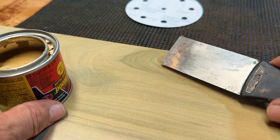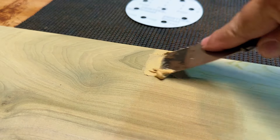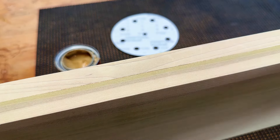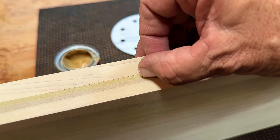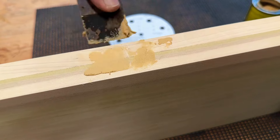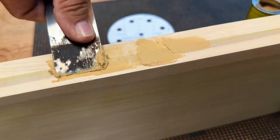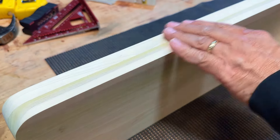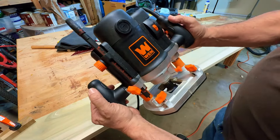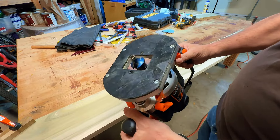After the second sanding I'm going to fill in these little voids and get it ready for paint - just put enough on there and we're going to sand it down. To get that perfect finish for the paint, see this glue seam right there? There's no void there but it looks like it, so if you're not sure just grab some filler and run it across there. Better safe than sorry. I'm gonna use this Wintech 15 amp variable speed plunge router with a Bosch half-inch round-over bit. This is a good router especially at its price point.